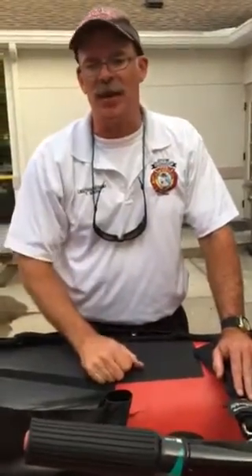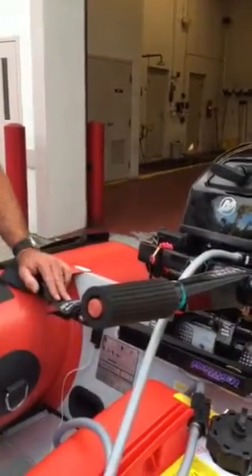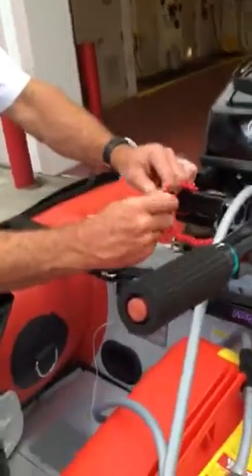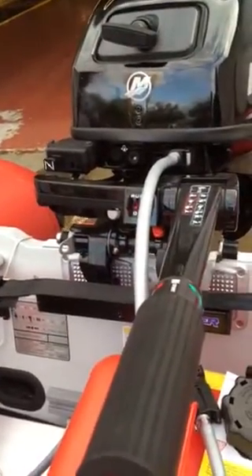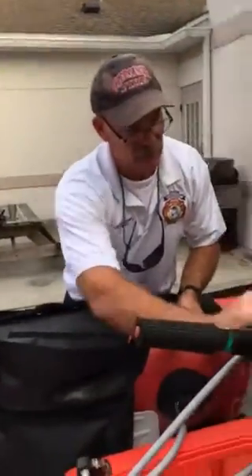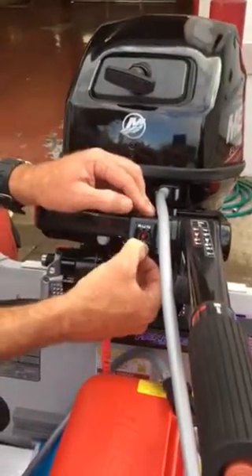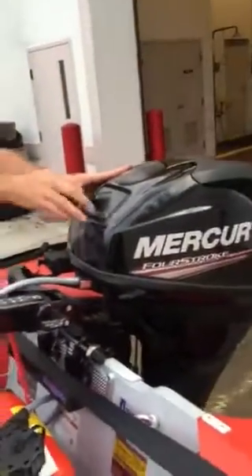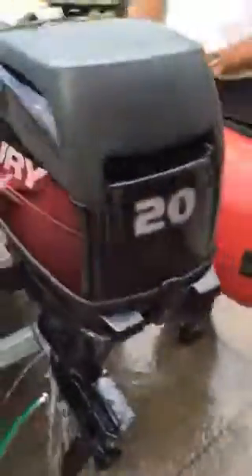In a panic situation, there are two ways to shut this boat down. You've got a kill switch located right here, and this will be for normally shutting off your motor. If you're in an emergency situation and you fall out of the boat, this lanyard would be attached to your life vest. If I fell overboard, the cord would come with me and it would shut the motor down. To get the kill switch back operational, you put your lanyard back into the switch, make sure it's down deep, flip it back into the run position, and you should be good to go.